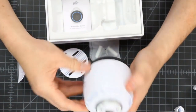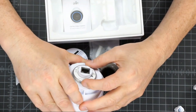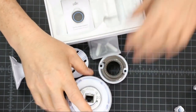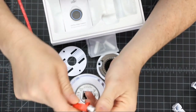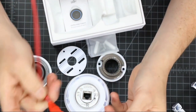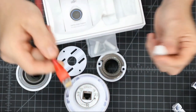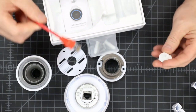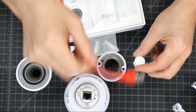Other than that, the camera itself is pretty simple. It has a tiny reset button — I've never had to use it, but if you forgot the password after setting one, that could be a problem. There's a standard RJ45 port. The boot accessory is tiny but will stretch over an RJ45 if needed, though ideally you should crimp the cable after pulling it through the boot — thread a no-end cable through first, then crimp the connector on.